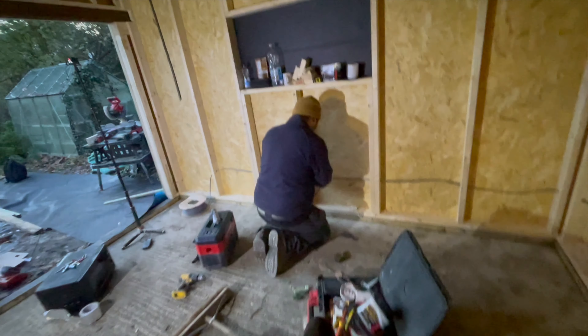It's a really cold one today — about minus one degree — so hopefully we'll make some good progress in the double soundproof room. We've got a second layer of insulation in, mechanically fixed with a 100mm screw and a washer just to hold it together before the inner shell goes in. The ceiling stays as one layer then there's an air gap and then the inner roof. You can already hear the difference in here — it zaps up a lot of the sound.